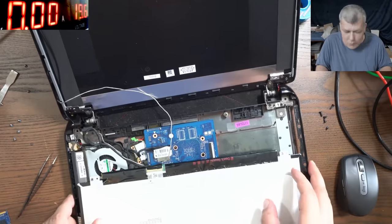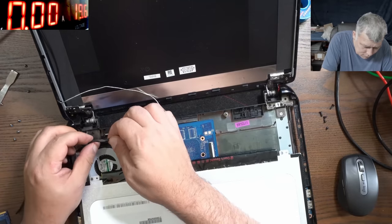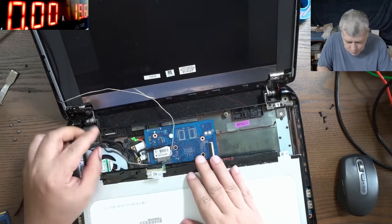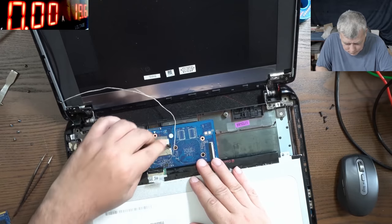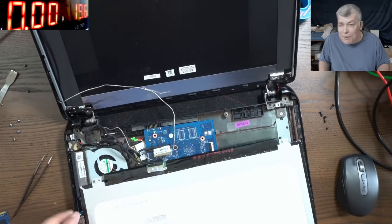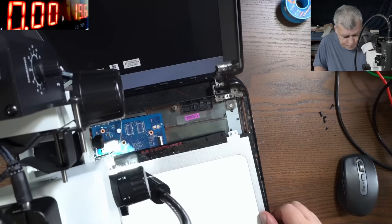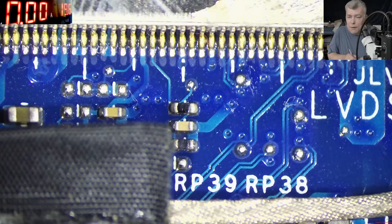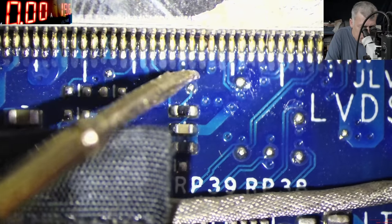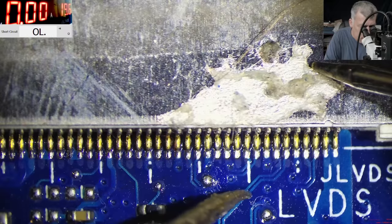I think there's nothing to do but check pin by pin the connectors. Otherwise, I can't really see what can be done here. We don't have another ribbon cable, so yeah. So check here. This doesn't seem right. So this is like a data pin. Yeah, this one. You see those lines are data lines. Two here, two here.